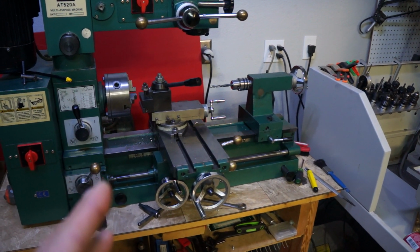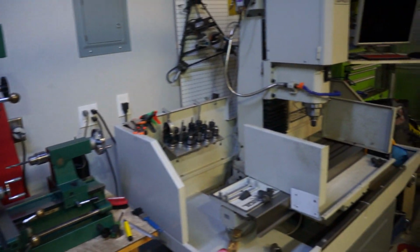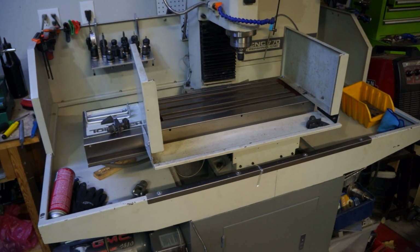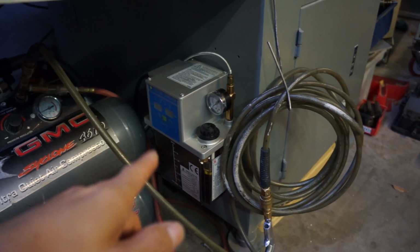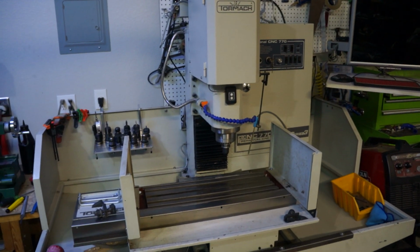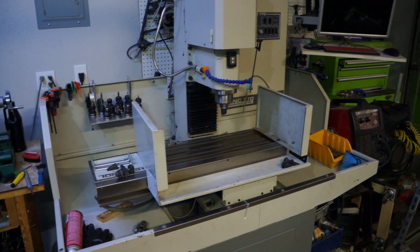But I managed to fix that. I ordered different nuts from somebody else for the Smithy machine, and then I was able to modify them to make them work in this machine. So I got that working again, tested a little bit, everything's working fine. My CNC, my Tormach, after 5 years of not turning it on or running at all, I was surprised that it still ran. Everything turned back on. I had to re-lube all of the rails. It's got the automatic lubricant for the rail and the spindle and everything, so I got that going again and got all of the oil back in, so everything's running smoothly. So I will get back into CNC stuff. Hopefully I can make some parts for other people so I can make a little bit of extra money or recover some of the initial cost of the machine.